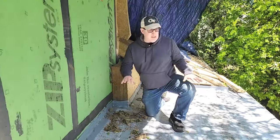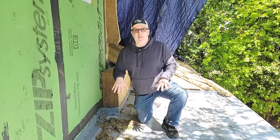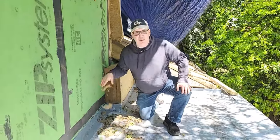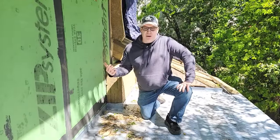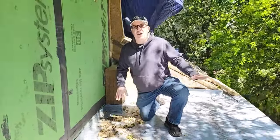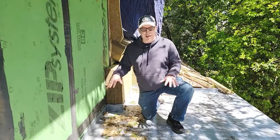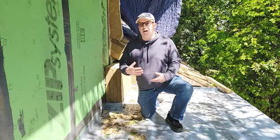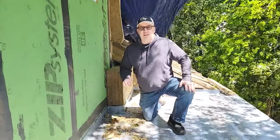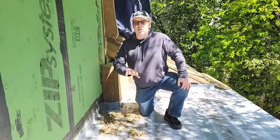If you notice the mess down here — we've got leaves and stuff all over the place. Lots of trees, we're in Atlanta — it's called Treelanta and this is the green city. A lot of people ask why aren't you just putting regular deck boards down here with some sort of floating system. The problem is all the leaves and debris are going to get in those grooves, clog it up, basically cause a dam and potentially let water get into the house. The reason you want to go with something that captures all the water immediately, sheds it off and doesn't have the capacity for debris to get into it — otherwise this is going to be a maintenance nightmare. I tend to find that most clients looking to maintain houses, if it does take maintenance, they usually don't do it. They call me back several years later when it's completely rotted. So I try to come up with maintenance-free designs and solutions just like this, so our clients can just enjoy their houses and not have to worry about what things they have to do.